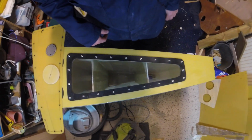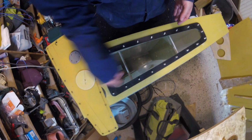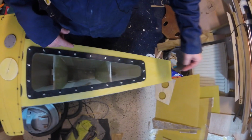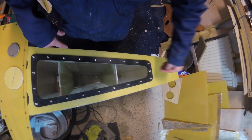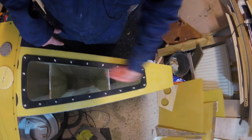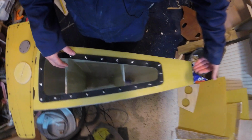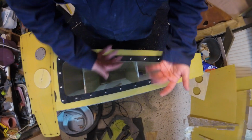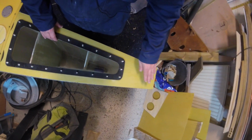As I mentioned before, I want to set up a fuel polishing unit for this tank, so that I draw it from the front there, send it through the fuel polisher, and then send it back here. I want to have a pipe that goes down inside that's bent to push back this way, so it really creates some turbulence in the fuel and pushes everything forward, so that it can mix up and try and suck out any diesel bug. So I want to make a return that comes back in here.